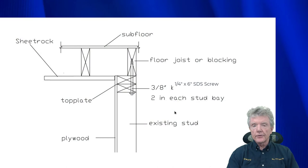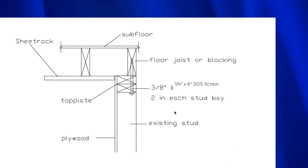In this video, I'm going to illustrate how lag screws can be used rather than L90s or some other type of frame and anchor in a seismic retrofit. This is a construction detail showing a lag screw that comes up here, penetrates through the lower top plate, the upper top plate, and goes directly into the middle of the floor joist.